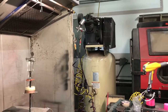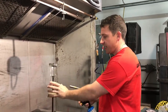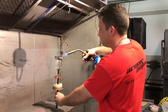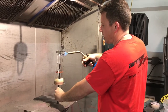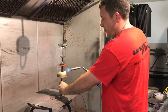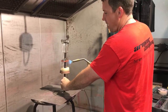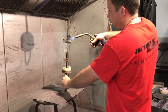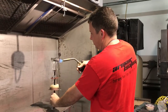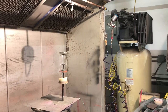So the next thing I do is hit it with the blowtorch — that's my trick right there. I get this base kind of hot. Of course it's going to get 400 degrees; the glass holds up to the temperature of the propane. This does a couple things: it'll burn off any greases or the alcohol I just put on there, burn off any lint that might have got on there, and I'll get it kind of warm — not super hot, but I will get that base kind of warm. And that's it, it's ready to coat.